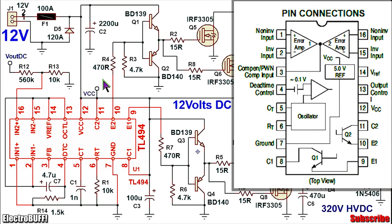The TL494 is a very good IC for use in inverters and switch mode power supplies. The IC has 16 pins and two error amplifiers and two output transistors. Pin 1 and 2 are the inputs of the first error amplifier. Pin 3 is the feedback — leave it unconnected as shown. Pin 4 is the dead-time control pin, and with this you can control the output duty cycle and it can also serve as a soft start control pin. This is done by connecting a small capacitor between pin 4 and the reference pin 14 and pulling down the dead-time control pin 4 through a resistor to ground as shown.